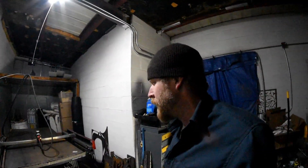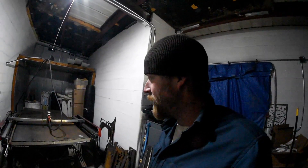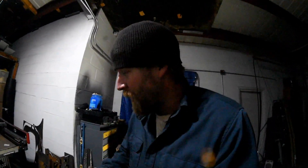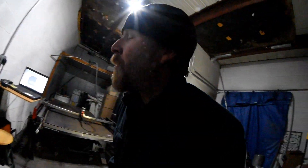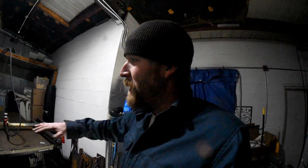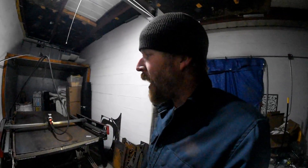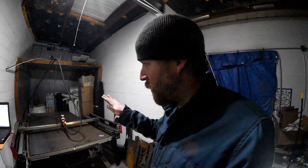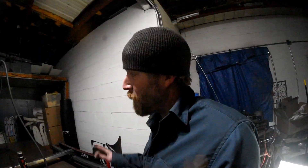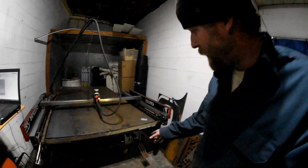As I suspected, I really don't need those rollers on there. It is kind of nice once you get the plate where it needs to go — it's easy to locate it — but I'm having to push the plate and the table at the same time, pushing the table with my hands and the plate against my biceps, and it kind of sucks. Friction would definitely be better, but there's going to be some drag anyway because all the slats have little barbs on them. I don't want to go any higher because I don't want the plate to sag. This is a pretty flimsy plate too; once I go with a quarter inch it ought to stiffen up, and I'm going to put an extension on the end and on this side to help hold it up. All in all, that's pretty cool.